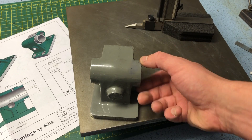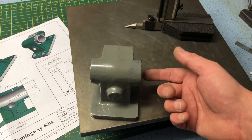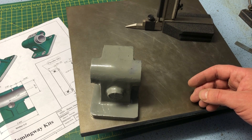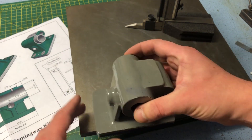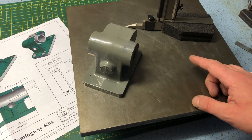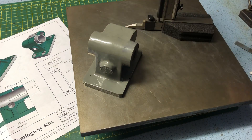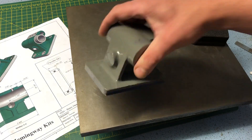Thomas designed this with the Myford 7 series lathes in mind, with the dividing head spindle bore being exactly on the lathe centre height when the dividing head is mounted on the lathe cross slide. This is guaranteed to be the case, as the spindle bore in the casting will be machined using a between-centres boring bar on the lathe itself. But unless we pay attention to the overall height of this casting, that bore could — and probably would — end up off-centre to the cylindrical portion of the casting. This wouldn't affect the operation of the dividing head, but it would look terrible. So with a bit of maths, I have determined that for my lathe and this casting, I will need to remove fifty-eight thousandths from the bottom of the base. I will scribe that using a height gauge, but the line is for visual reference only — I find it really helps when fixturing the part and ensures I have clearance from the angle plate.